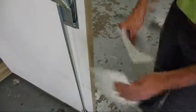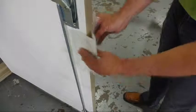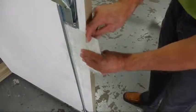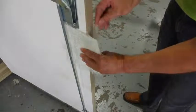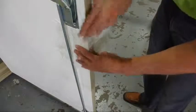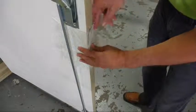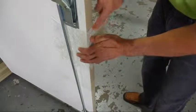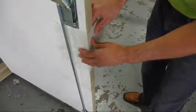In typical fiberglass door construction, the fiberglass from the inside skin and the fiberglass from the outside skin meet at a joint. The doors form that way and the joint hardens, and after the door is out of the mold, this flashing, this flange gets cut off, leaving a joint. The fiberglass is present, but it does not continuously wrap around the door, leaving a joint that can separate.